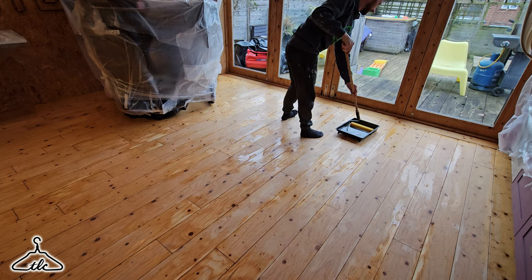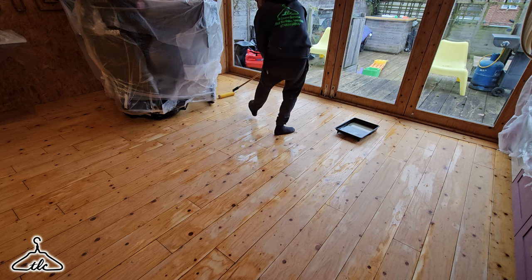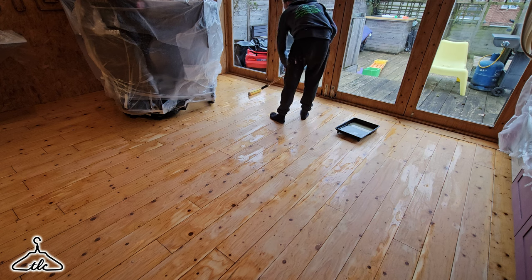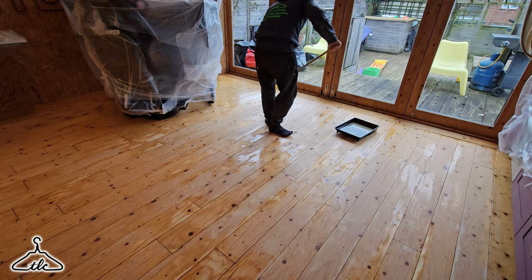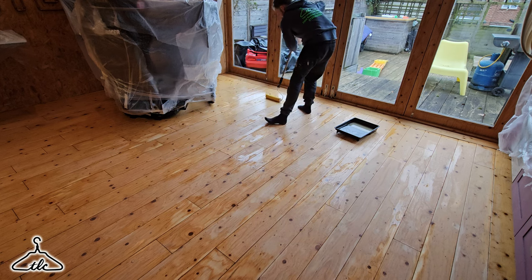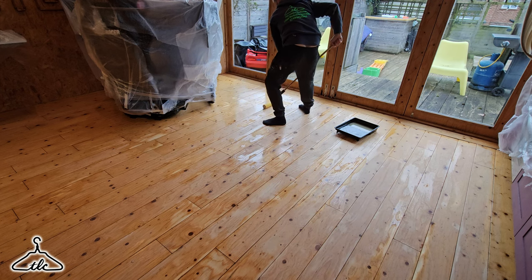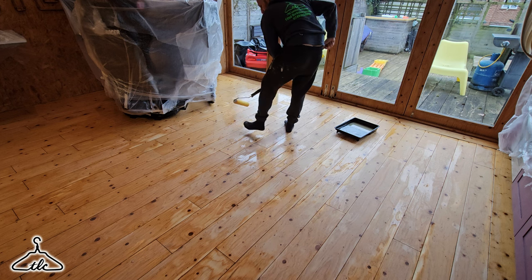You've just got to do it methodically — do it in little squares. These nine-inch gloss rollers are brilliant. Before I started spraying, I used to use these — I had all my MDF components for wardrobes out on trestles with ladders across them, and I'd use these nine-inch gloss rollers to roll paint on quickly. It gave a nice consistent finish because the roller is so big, it covers a lot — you need less up and downs. I bought a batch of the Pro Deck ones in bulk. The beauty of cutting in first is I don't need to be neat; as long as I go within two inches of the wall or skirting, should be fine.